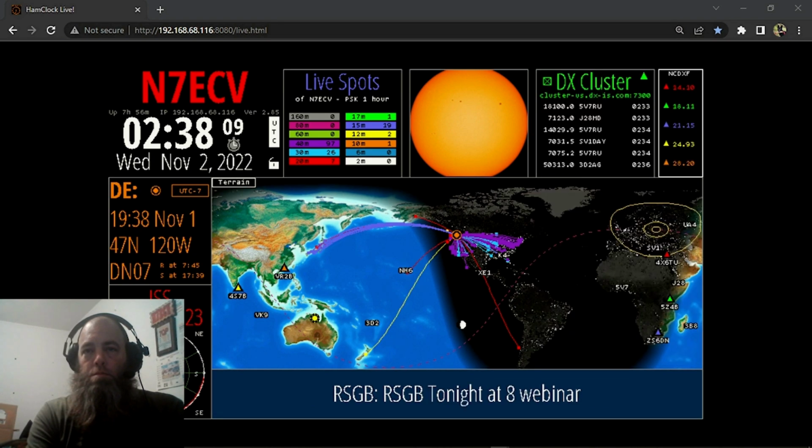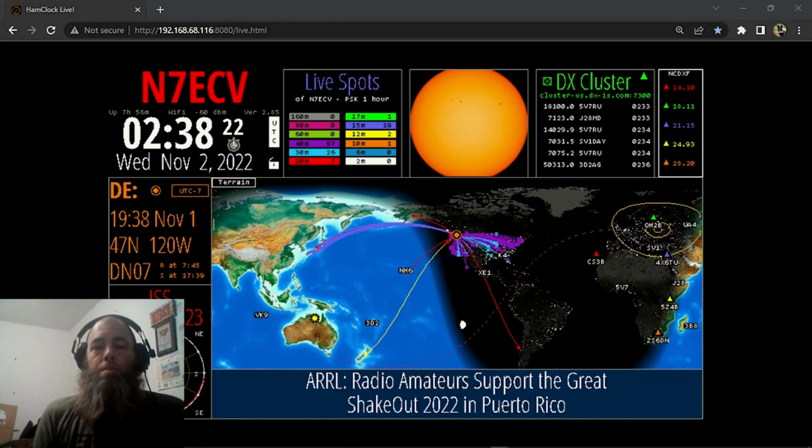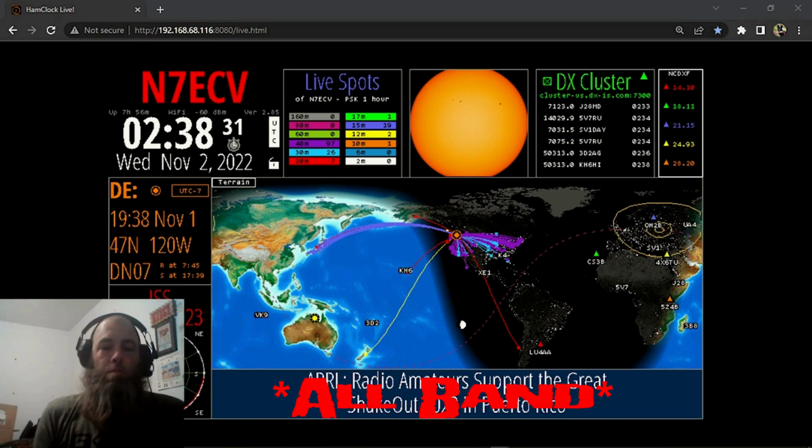I don't need an antenna tuner, even at 100 watts out, or even at high power on some of the bands. It's completely flat on 20, 40, 15, and 10 there for me. It works really good. I don't even worry about it with my amplifiers in line. The Vibroplex PAR Endfedz 10 through 80 1 kilowatt. It's the antenna I'm using nowadays, and the map is visual proof, guys.